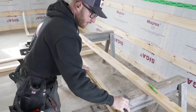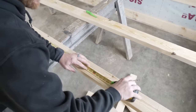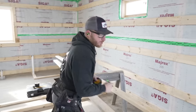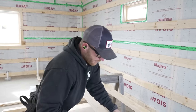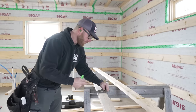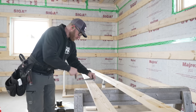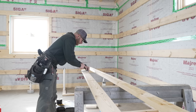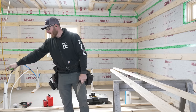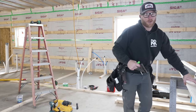The more accurate you build, everything has to be accurate. You can't just be blowing and going — you've got to always be consciously minded about what your actions are going to lead to down the road so you don't hurt the finisher, the drywaller, or whoever it is. This end starts where I've got a perfect plumb line that matches the plate at the bottom, which also starts on that perfect plumb line. So I can assure that all these studs are going to go up plumb as well.